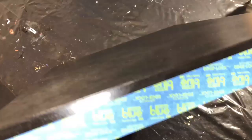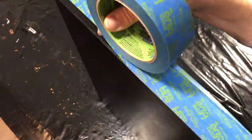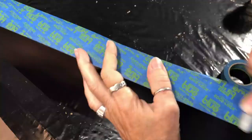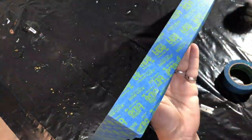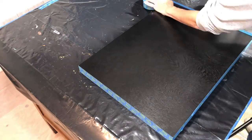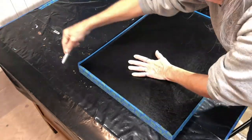I'm going to do this in time-lapse. I'm putting down my first layer of tape — I like to do that at the lower edge. Then I go back and I line up carefully along the top edge of my board. I find that doing it in this manner, the resin that I don't want on my sides will flow past that top layer of tape, and it really keeps it nice and tight. The tape does flex a little bit, so be careful and rub that down in and you'll get a nice seal.